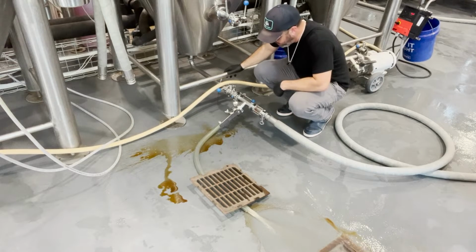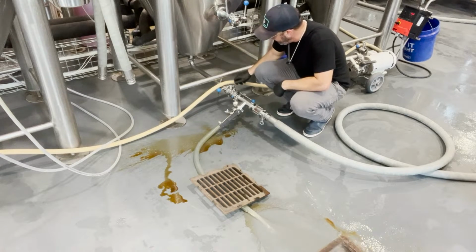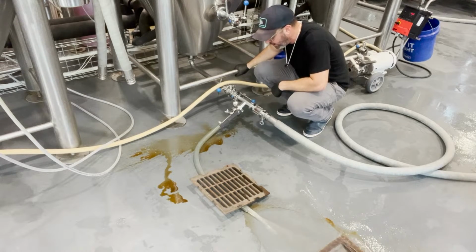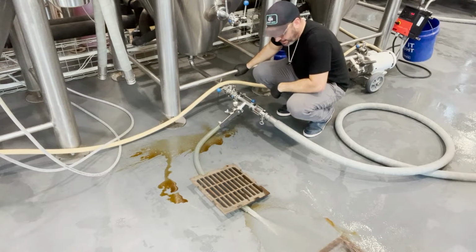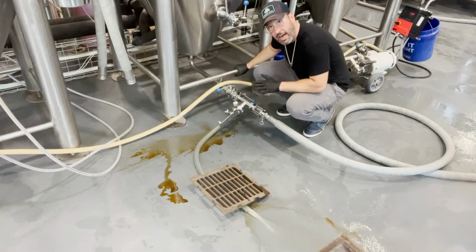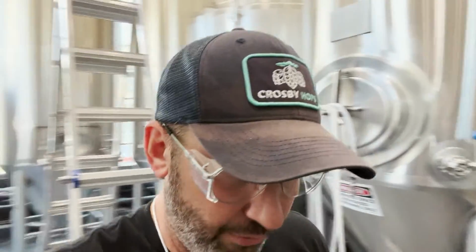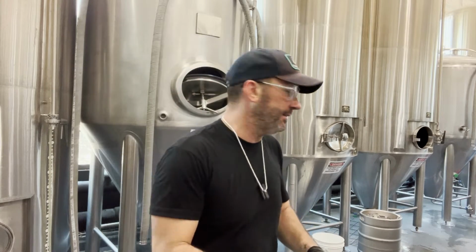And so I am starting to get to some high quality hot liquor tank water. So I'm going to cut this right here because I have a lot of soil backed out through here. So we can check box one right now. I have all of my wort ways rinsed. So everything that saw wort, whether it be the whirlpool arm, various pipes to various pumps, different things like that, all that is rinsed through with hot liquor tank water.